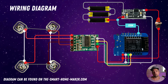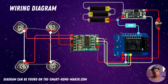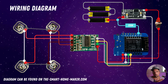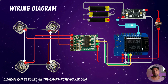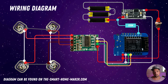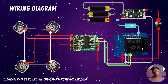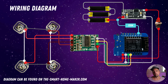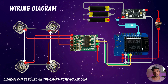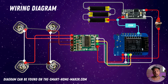And we have to, of course, make sure that the DC-DC step-up converter is configured in a way that it outputs 5 volts. For the model you see in this picture, it's quite easy. They have some small resistors, and depending on how you set those small resistors, you can just adjust the voltage. And for this exact model here, we just have to unsolder those two resistors to make sure that it will add up to 5 volts power.